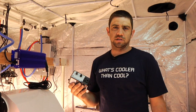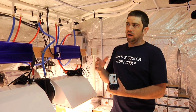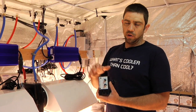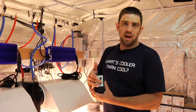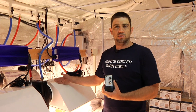Just like any other air conditioning system, you need a way to regulate the temperature. This is the icebox thermostat. You plug your fans into this and plug this into your wall. You've got a temperature probe that hangs in your room and night and day settings. What this unit does is speed the fans up and slow them down as you need cooling. During the on cycle, the fans will rev up until the room temperature is reached, and then it will steadily slow the fan speeds down to an idle. With the photo cell setup, you can set a night temperature, and at night the system will actually cut off — cut the fans completely off. The reason we do that is because you never want to stop airflow through your reflectors during the on cycle.